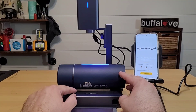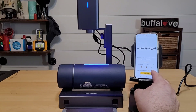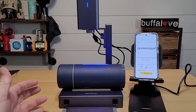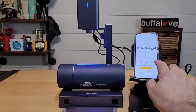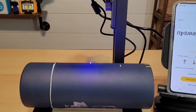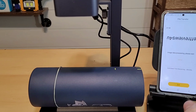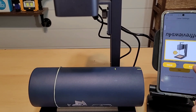The preview shows me a blue line — orange for me through the goggles — to line up where the print will start. The rubber band connects to the roller wheels but doesn't make contact with the laser line since you don't want the laser to zap it. Hitting scroll preview on the app shows the tumbler scrolling to reveal the full print area. I can see the center point dot on the mug. Once lined up, we quit the preview, confirm the material is stainless steel at 100%, hit start and continue — I am wearing goggles, in a well-ventilated room with windows open.